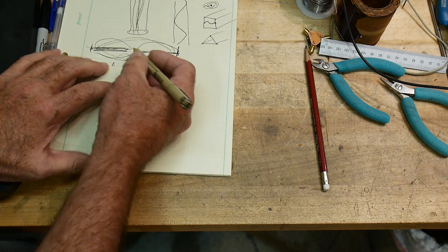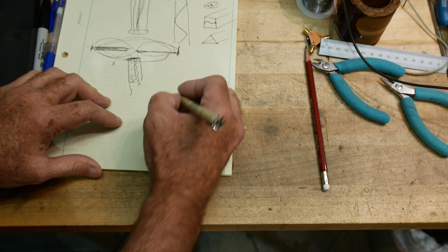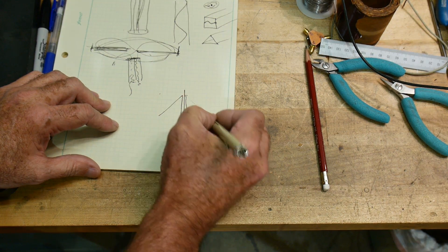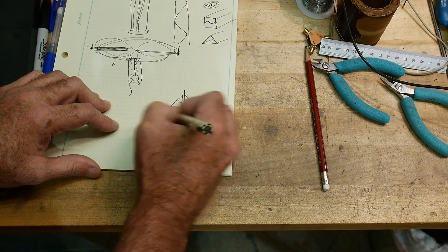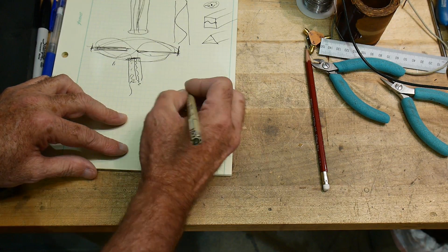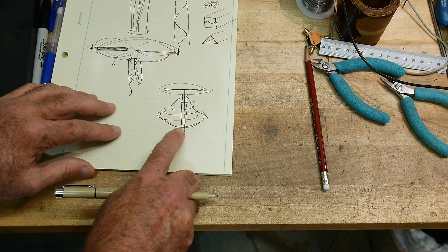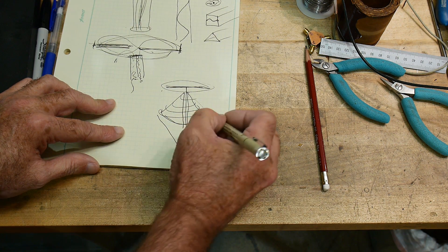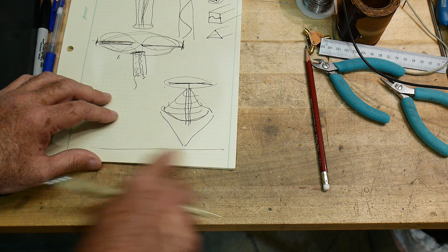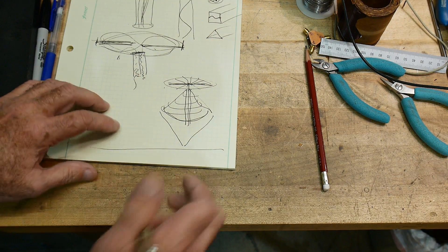One of my favorite antennas is the discone antenna. If you have a transmission line, the center conductor comes out, but you put a metal cone — a big metal skirt like a funnel — around it. Then you take the top and put a pie plate on top of it. This disc-cone antenna is super, super cool. Sometimes you'll see them with a bottom section too. If you ever go aboard a Navy ship, look for these — they use the ship as one reflector and the top as a different reflector. Sometimes the elements are just wires sticking out, sometimes horizontal, sometimes vertical.